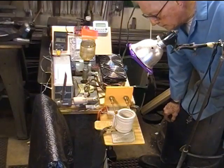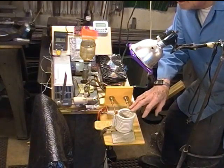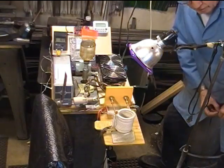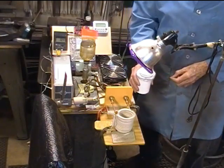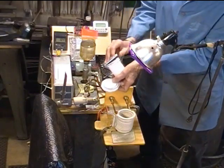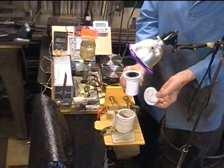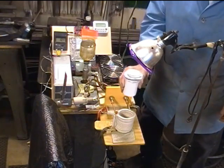Today we're simply going to melt a little bit of copper and check to see if a couple of different filters will give us a better shot at what's actually going on inside the crucible when the copper melts. I'm also still working on the idea of keeping more of the heat in. I've made a couple of rings of insulation to go around this particular crucible so that even the top part that sticks out of the ceramic crucible is covered, and I've made a heavier bunch of covers to try to keep more heat in today.